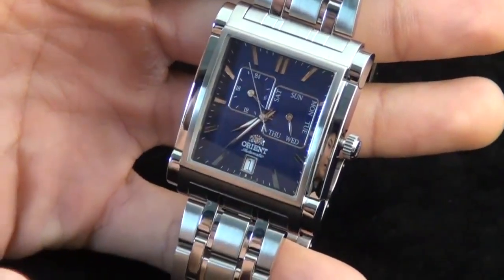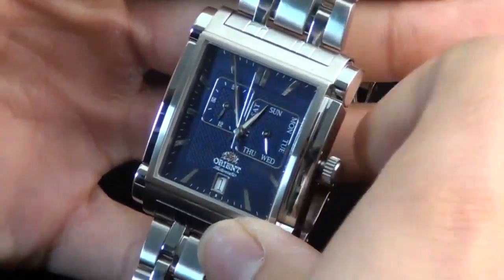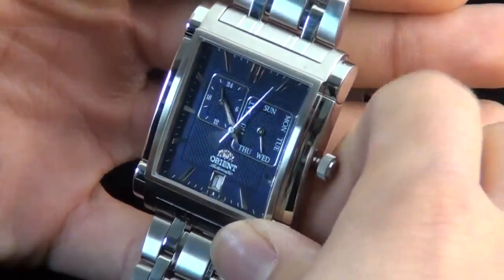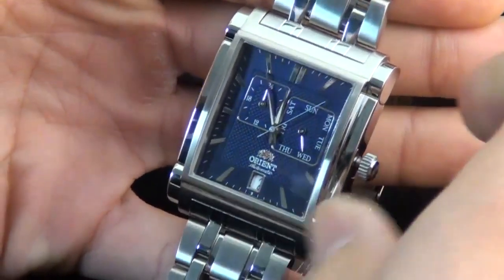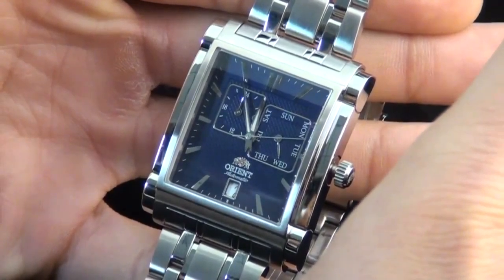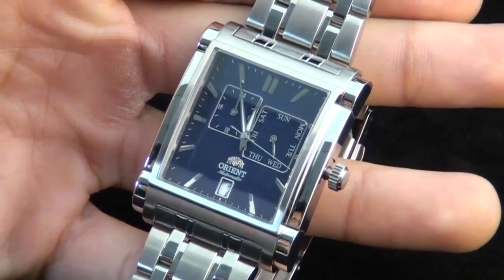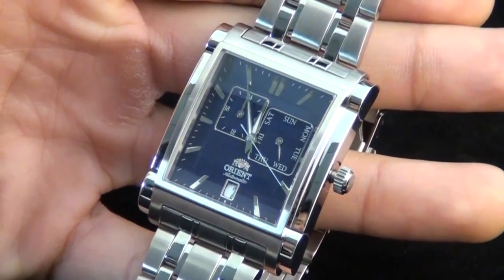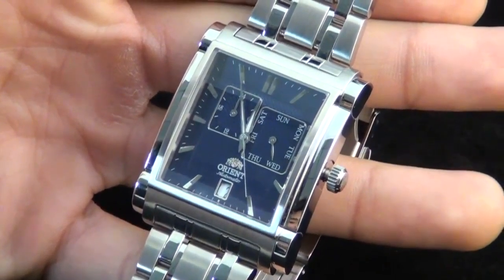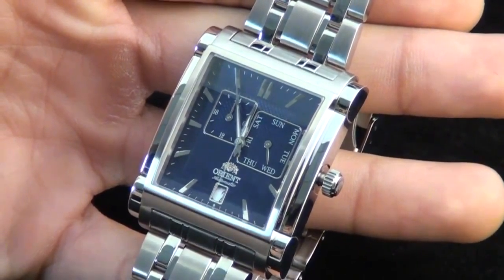You'll notice from the 24-hour indicator that I'm on the AM portion, so even if I cross 12, the day is not going to be affected. Now, how do you pivot the day wheel? Here's midnight. Somewhere between around 1:30 and 3:15 you're going to see two pivots. Orient watches typically use two pivots because we use a wheel that has both Spanish or English, or French and German — two languages — so you'll see two pivots, and this is absolutely normal for an Orient movement.